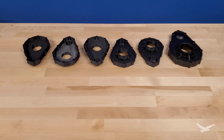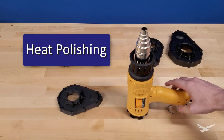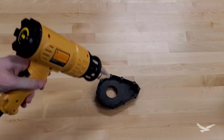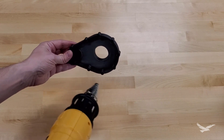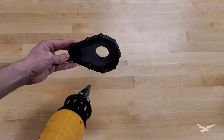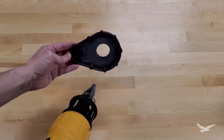So let's go back to the start with a part that we've only sanded with two different low grits, and explore our next option: heat polishing. As the name implies, this one is fairly self-explanatory. We've spent a few minutes sanding this enclosure and have decided that the smoothness is good as is. However, we don't want to paint this, but would like some of the original color back. So using a heat gun, the goal is to very briefly bring the surface up to near its melting point, which will change the physical properties of our outer layers and bring back some of that nice base color.